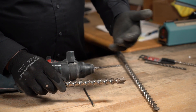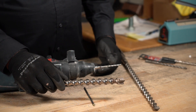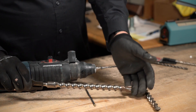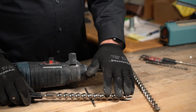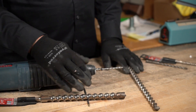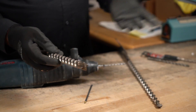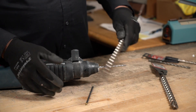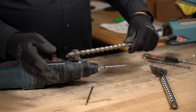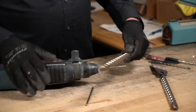These quad-head bits work very efficiently — probably about 25% faster when drilling into concrete. So if you're doing a lot of drill holes in concrete, a quad is the way to go. If you're doing hundreds of holes on a project, this is what you want. If you're just doing a couple of holes, you're better off with the single carbide.